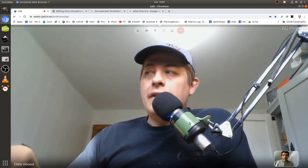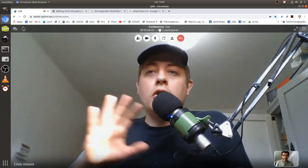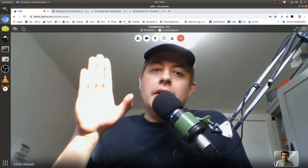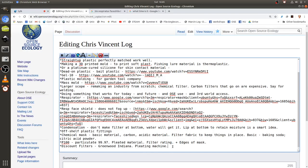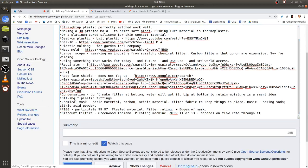Their MERV 11, I believe, and I don't know if it's all this way, but their MERV 11 and MERV 13 material is actually the same material. It's just rated differently based on the airflow rate. Based on airflow, okay. Depending on what your flow rate is, it either flows like a MERV 11 but removes particles like a MERV 13. So it's a bit of a fancier material, and it costs more, but they get better utilization out of it by having one less SKU of material.